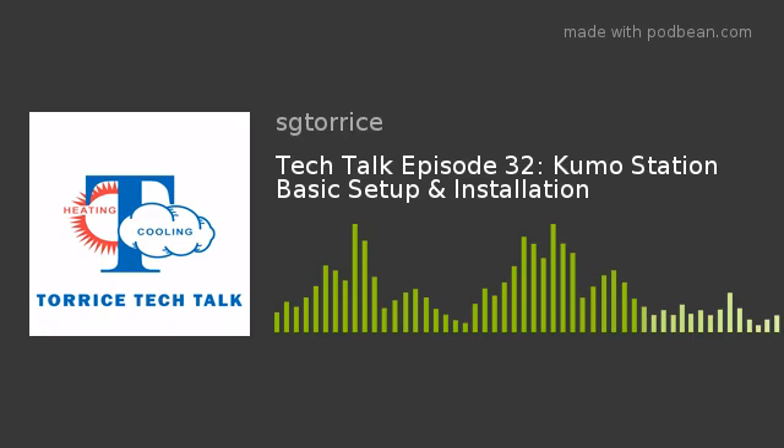Start with the Kumo Station powered off. Locate switch bank SW-1 and turn switch number five on — that's for using the wireless interface with a non-interlocked indoor unit. If it were interlocked, switch number five would be off. If any relay configuration other than normally open dry contacts is required, make those changes now. For example, if you want to make relays three and four wet contacts outputting 24 volts, change your dip switches at this point.